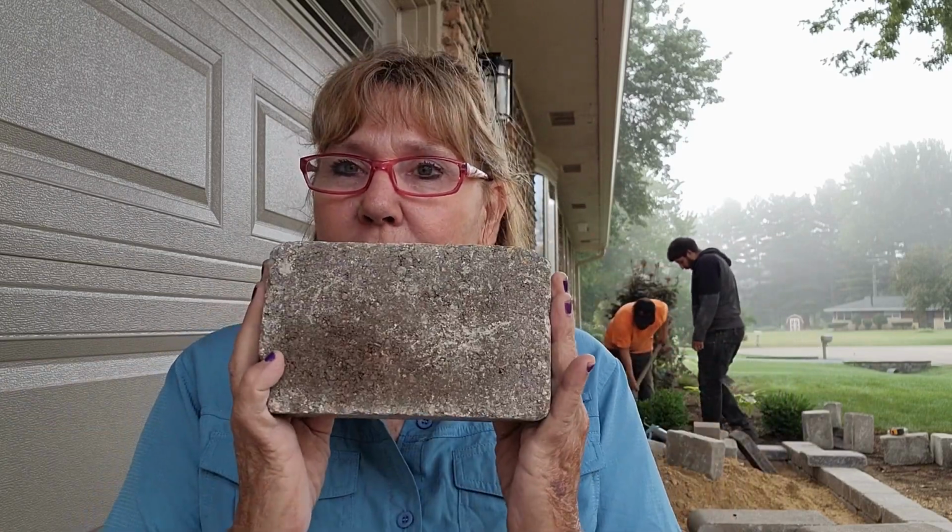And then we need to have a paver brick that we're going to put on the top of the stoop when we're all done building the frame and the wall and the step. We need to have brick that we're going to put on top. So after the guys compact in the gravel in the frame that we build, they'll compact that in 2-inch lifts. Then we'll screed in just a 1/2 inch of sand. We're going to put pavers on top of that.